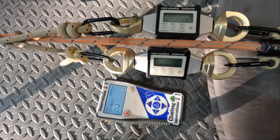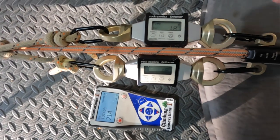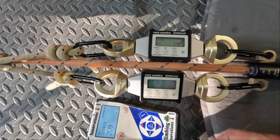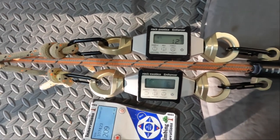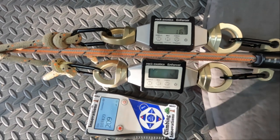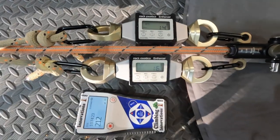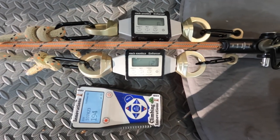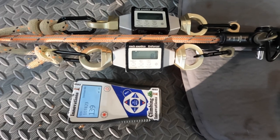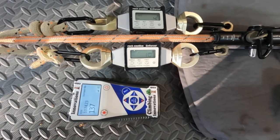I've turned off the hydraulics and everything, but you can see this is holding right now at about 212 pounds and the hitch cord is holding 14 on one side and 14 on the other — so about 28 pounds. The controllable part is about 28 pounds as opposed to the climber weight being in the 200-pound range. I'll release the hitch and you can see it's going down — 150 pounds dropping to 4 and 8, about 14 to 15 pounds out of 130 pounds.